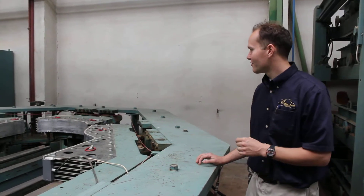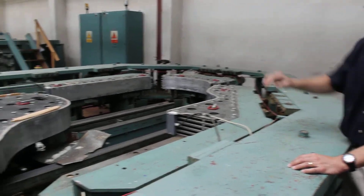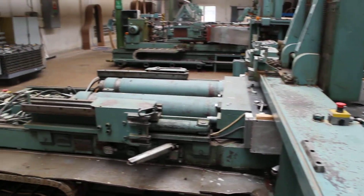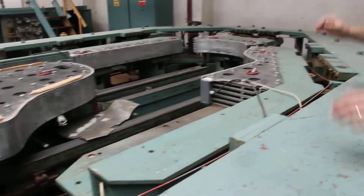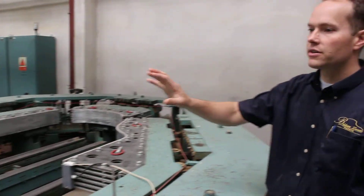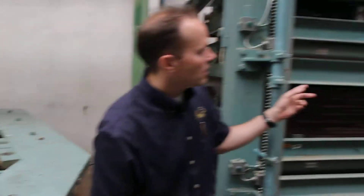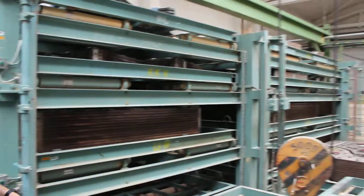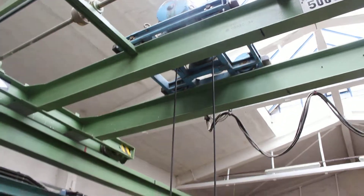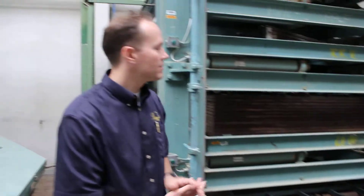This is very impressive. So with this giant machine, once they get the laminate sheets in here, this all comes together with an enormous amount of pressure and it's heated so that it dries in that shape. They've got different shapes for their various different models, and all of these parts here — with this giant crane — enable them to switch it out depending on production. They'll switch out the machines to make the rims they need.